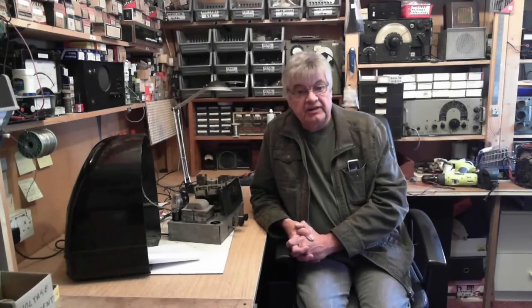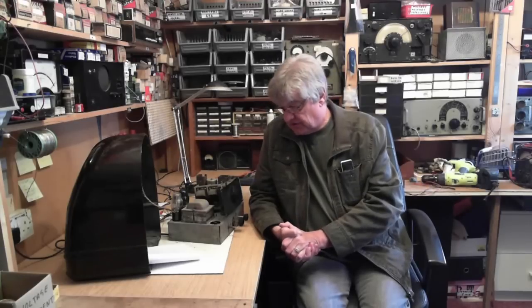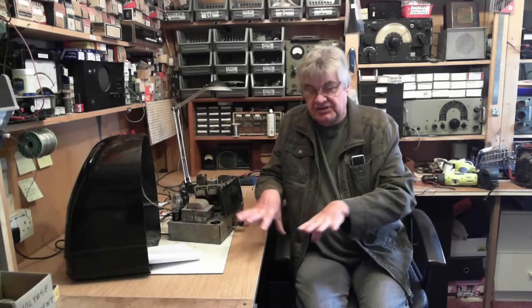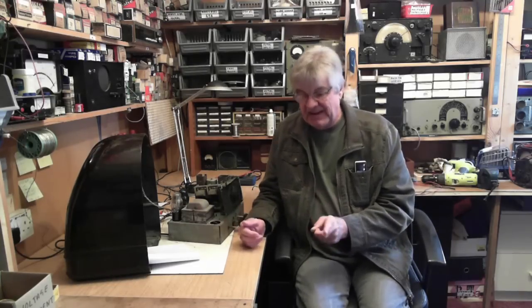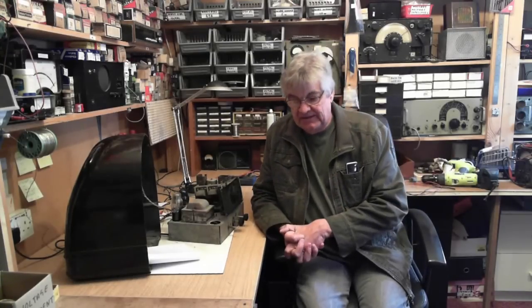So what I've done is created a members area within the Radio Workshop website — it's a password-protected area where I've produced videos. For example, all about isolating transformers: why you need one in the workshop, what it's for, what it does. Also speaker grill cloth — I'm working on that video shortly — how to stretch the speaker cloth over the baffle board and glue it. It's got to be as tight as a drum; there is a bit of a knack, otherwise the cloth will be loose and flap about and it looks terrible.